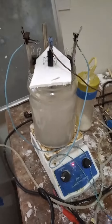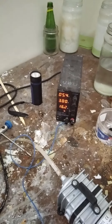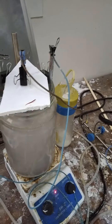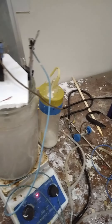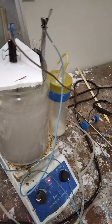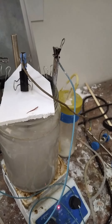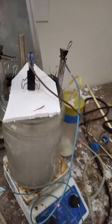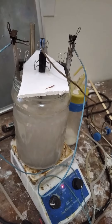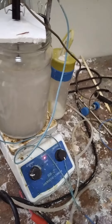I've altered the setup a bit — I've added some sodium chlorate and potassium perchlorate and upped the amps. This is still not an ideal setup. The electrode spacing is very large; based on running it in the plating cell, this would run at about 150–200 mA per centimeter squared if I were to have a saturated solution, but this is a test solution.